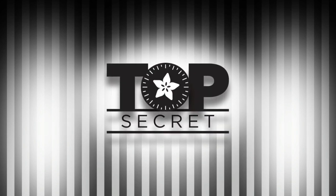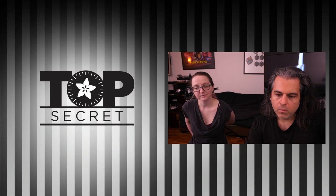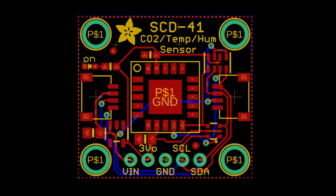We have CO2 sensors which are wonderful, and we saw from Sensirion they're coming with a new sensor — an upgrade to the SCD30, it's the SCD41. It's $11 more. This is a very small CO2, temperature, and humidity sensor — I think it's a true CO2 sensor — and it's just very tiny. We thought we would make a little STEMMA QT breakout for it. It's I2C, and they wrote a driver for Arduino and Python, so it'll be super ready to go, very fast.